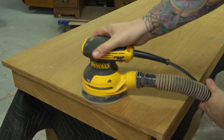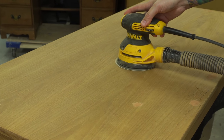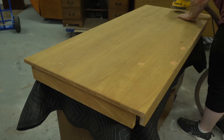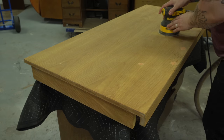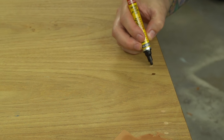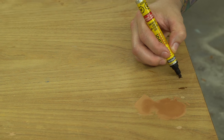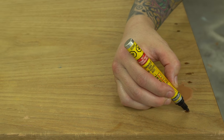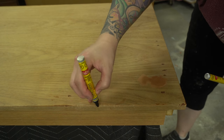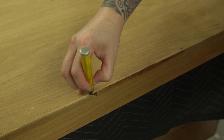This top has been drying while I've been finishing up and oiling all the other sections. I'm doing a 220 grit here for my final sanding and I'll take some time to get out as many of the scratches as possible. There are definitely some I can't remove, and one of the things about doing this as a job is that you sometimes have to realize you can't get things perfect. This piece is probably 50 or 60 years old by now — you have to accept that there are going to be imperfections and that's just the way it is. I added a second layer of filler and I'm using a stain touch-up marker to go over the areas where I used wood filler, which will help blend the color a little more once I apply the Odies.